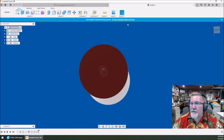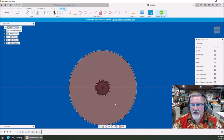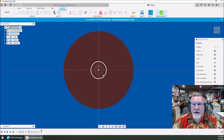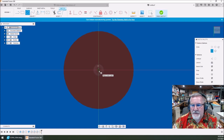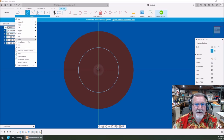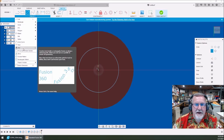We're back down here on the bottom. Hit sketch mode — I'm going to select this bottom surface. Now, when you draw letters on an arc, you've got to draw the arc first. So I'm going to come back to the center, do a circle — wherever you want your letters to start. Whatever circle I do, the letters are going to be on the outside. Under 'create text,' boom — come over here. See this 'text on path'? Boom.